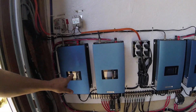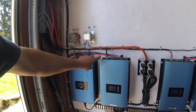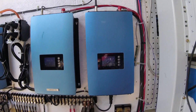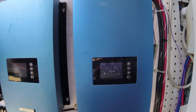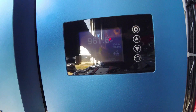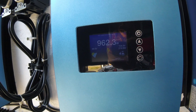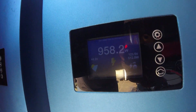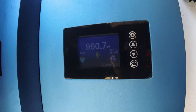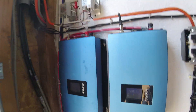These are auto-islanding 1,000-watt inverters. I'm running at 120 volts. So there's 2,000 watts for line one, and another 2,000 watts available in line two. It's running 960 watts — that's AC. There's 963. So almost 2,000 watts in the house. There's another 958, 953. At the very bottom there's a 5-something — that's how many watts are being drawn from commercial power.